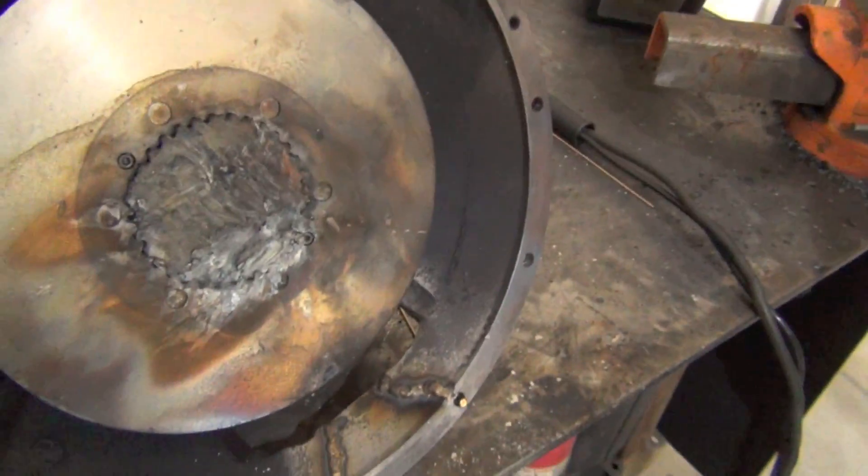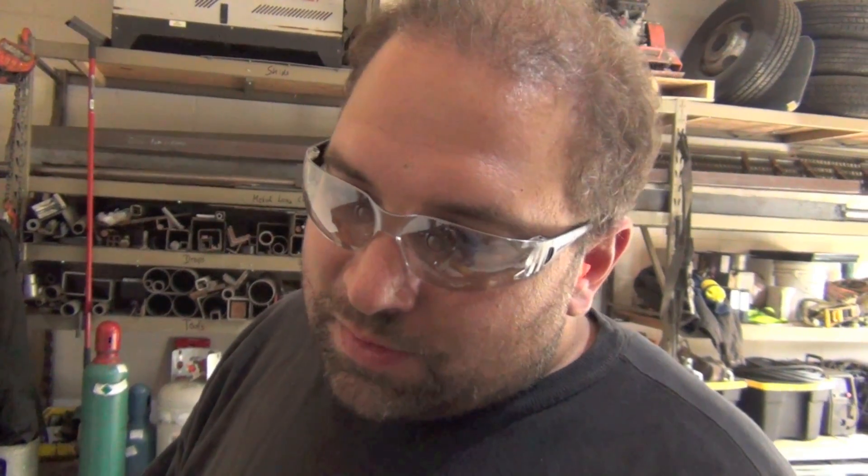You spark test, you drill test, see how the chips come out, then you take your best guess and best shot. It all depends on what it is. If this was an actual clutch with the hydraulic actuator in it, obviously you cannot heat it like this unless you strip the entire casting. That's why if you weld it cold you don't have to strip it. There are so many different things to watch out for - it's not cut and dry. This is just one way that works on this specific casting.